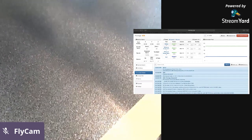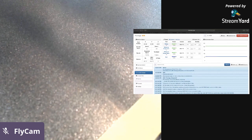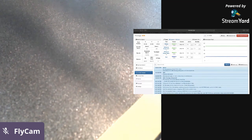There are all kinds of things you can set in here. So we do have limits on speed, or on feed rates. We have acceleration limits, which seem fine. Minimum feed rates we have. So there are many ways that you can reduce the speed of the printer, and any one of those could be causing this. Or it could be something completely independent. See, here is a max print speed. If you set all these up here and you don't pay attention to this.